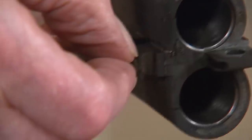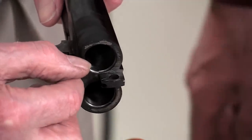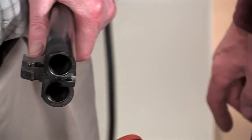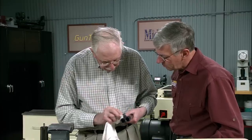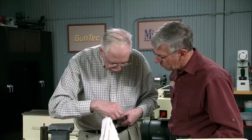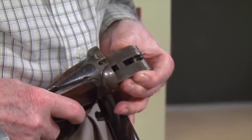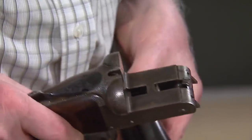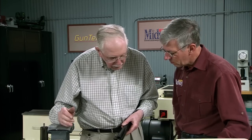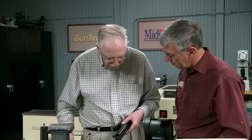I'll draw up metal to tighten that bite. I'll draw metal upwards so the underbolt bears harder on this surface where it fits than it does now, and that should hold it tight. In some cases I would also tighten the gun by giving it a squeeze — squeeze the action in across the area of the front lump. But we're not in a position to do that here because we don't have a vice with enough power. You'd need something like a blacksmith's vice.